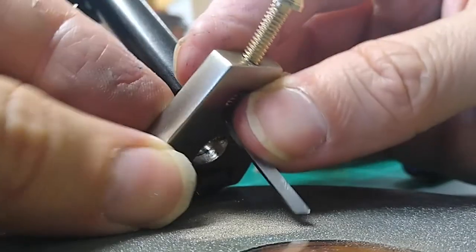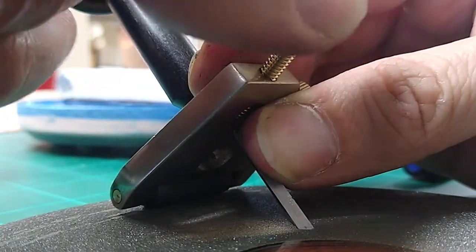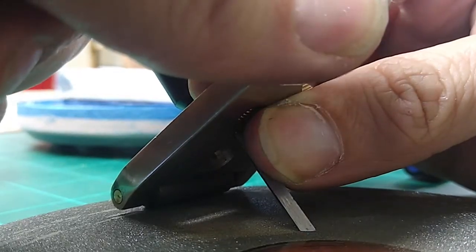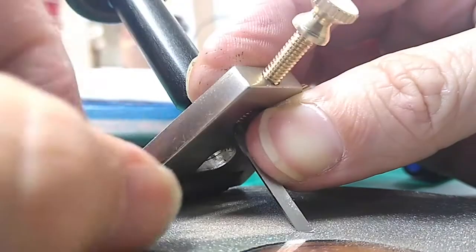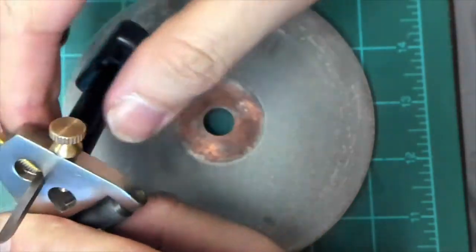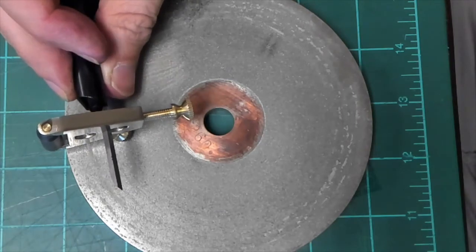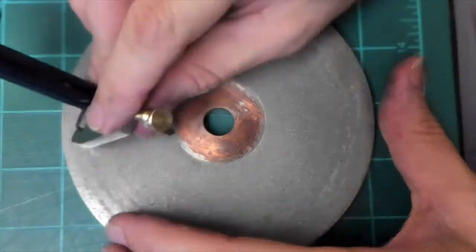Place the graver in the jig and try to get the face flat on the stone. Sometimes it won't be perfectly flat. This is okay. You can grind the face until it is. Make sure the screw is securely tight so it doesn't move. You can use a rag to firmly grip the screw to tighten it. Once it is tightened, look at the graver and the jig from the side to make sure that it is placed in straight. It is possible that it would be crooked.